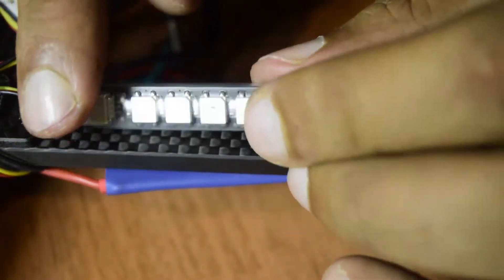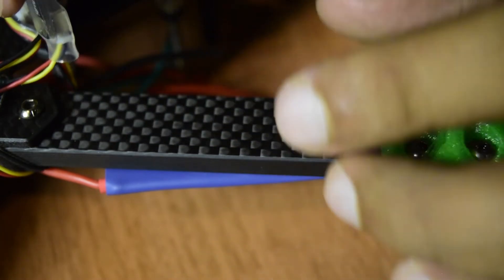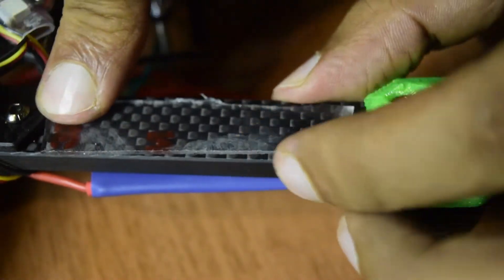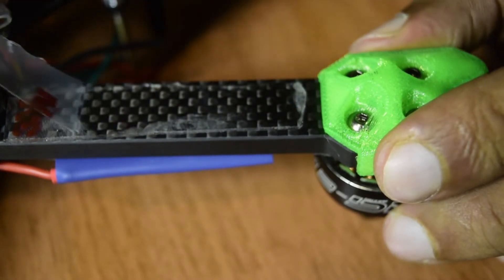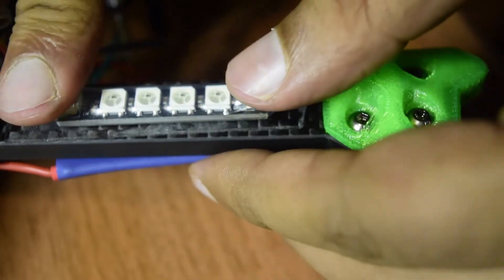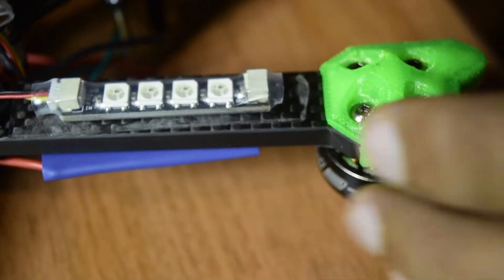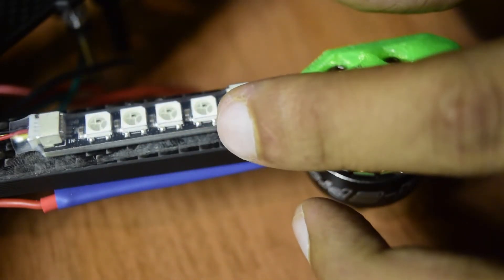Everything is now perfectly aligned. Now let me stick the LED strips on the back side of each arm of the drone frame using 3M DST tape. Let me put the DST right here on the back of the arm and remove the other side of the cover. Peel it off and push the LED strip right onto the DST so it stays in place. Now I'll repeat the process for all four arms. Since I have finished installation of the DST on the back side of each LED strip, let's reinforce this bond.